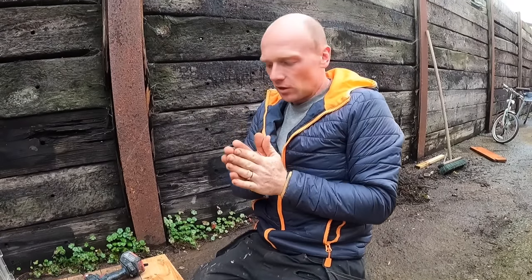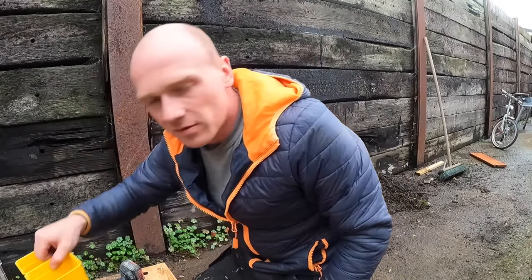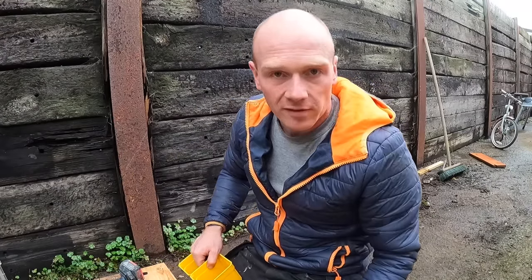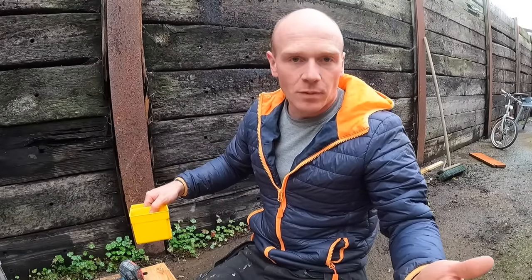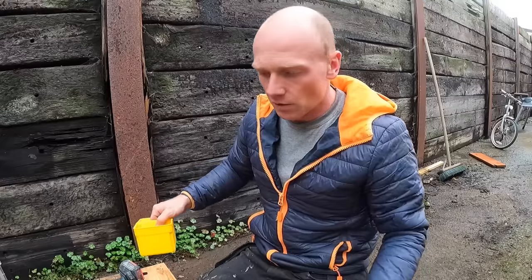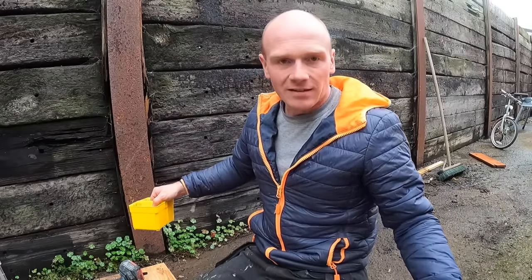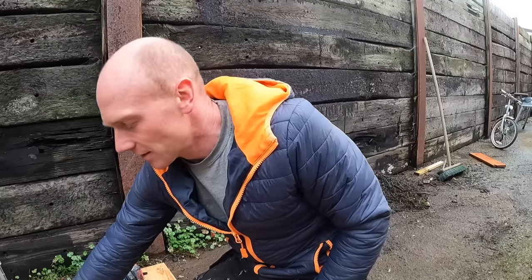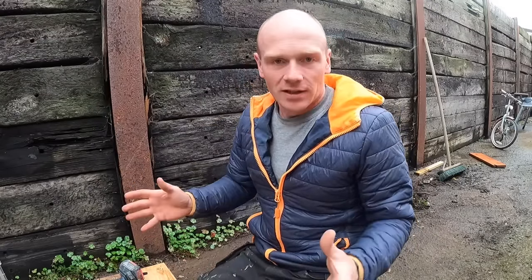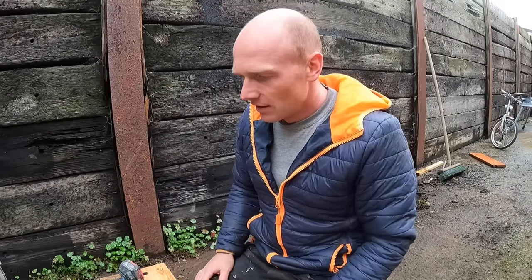There are always better ways to do things. For example, this floor I've just screwed in with normal bog-standard wood screws — they've corroded a little over the years. The textbook would say you need stainless steel fixings, and yes, if I was starting again I'd probably nail the whole thing with stainless steel nails and use screws to put it together. But in reality it's low risk — it's a shed. You don't want to overthink it. Sketch something down and give it a go, because you're not going to learn unless you make some mistakes.